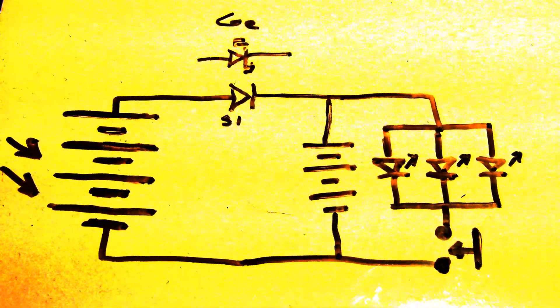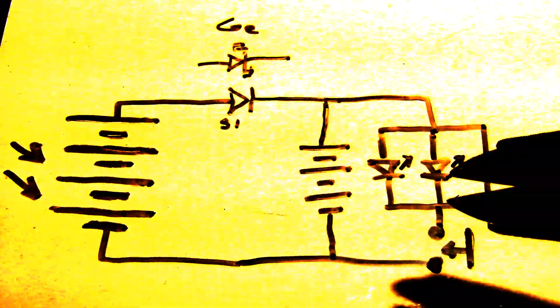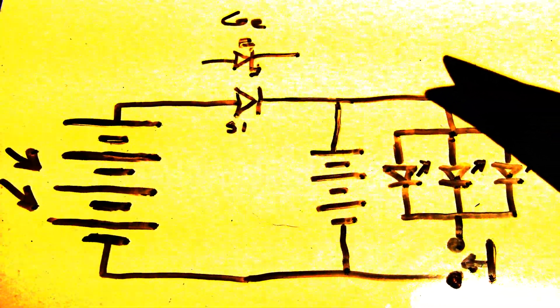This is just an approximate circuit — I didn't actually trace it out. Basically you'll have a solar cell with a little more voltage than the battery needs for full charge, enough to make up for the diode drop. The diode is used as a check valve — just to keep the solar cell from draining the battery down at night, so it doesn't become a resistive load on the battery. Then there are three LEDs in parallel and an on-off momentary contact switch. I didn't analyze whether it was a silicon diode, a Schottky diode, or even a germanium diode — any of which would work. They just have to make the cell the right voltage to overcome that and give you the right charging voltage.